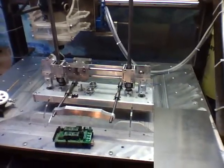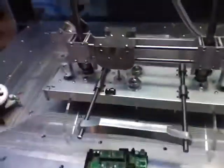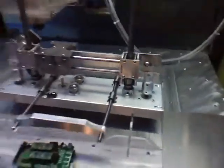Loving my cool mist spraying down the bit - it's incredible. This guy here clamps on the router - this is my mud flap, which keeps the mist from just spraying crap all over the machine. It still gets everywhere but this catches probably 80% of it and it all just kind of gets caught and puddled up on the table. I can shop-vac it out. Last but not least, I've got to make a case for the screen because I'm using the new Marlin firmware, and my encoder wheel that I made a while ago - that's gotta go somewhere too.